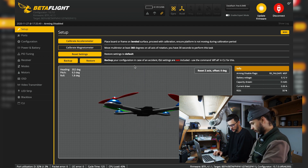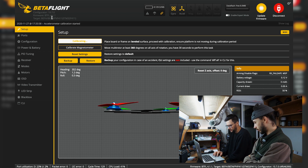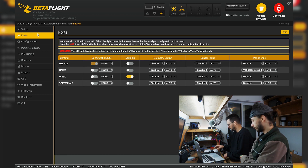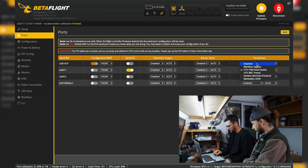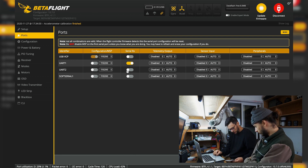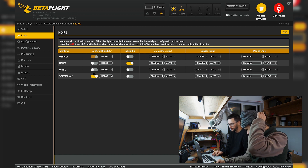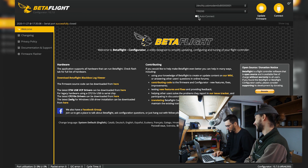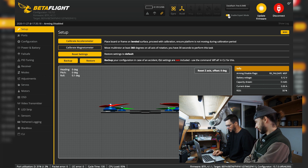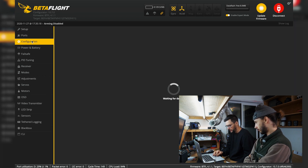We're checking the accelerometer — let's give it the calibration. It's running Betaflight 4.1 so I'm cool with that. UART1 is our TBS Nano receiver. UART2 is our GPS — set sensor to GPS. You also have to turn on MSP here in configuration — it's actually a soft serial. Turning this on is what allows the OSD to show up on your DJI goggles. Save and reboot, auto connect, expert mode on.